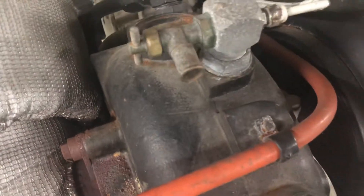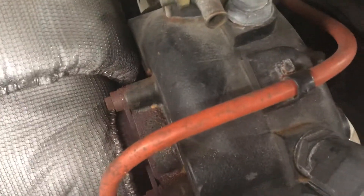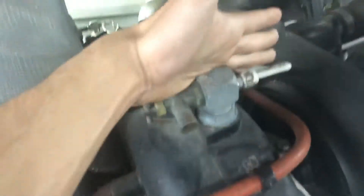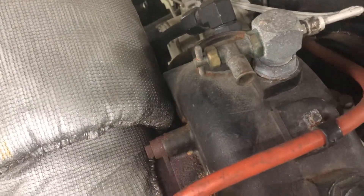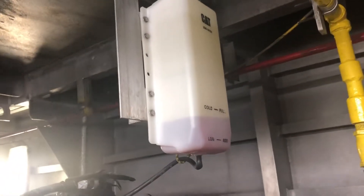Even when adding your distilled water, what we like to do is top the engine off with distilled water. It's much easier to top it off when those air ports are open, because it tends to bubble up out of the heat exchanger if you're pumping it in pretty fast. Open those up, drain it once more — that's just to clean the system. We also like to take that time to remove the day tank and give it a good cleaning. After three years, that thing gets pretty gunky and nasty.